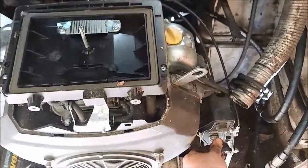All right, so the cut spacer has been put on, the key is on. Now it's time to reassemble. Probably about 1/8 inch play back and forth, or about 1/4 inch. I think that'll be okay. And if it breaks again, we'll have to key it. We'll have to put shear pins and all that. But I think this will be good for testing. We'll see how it does.